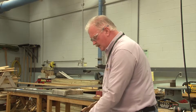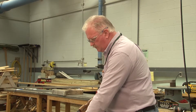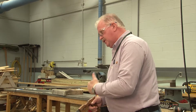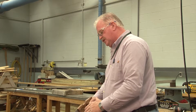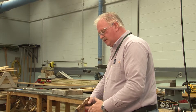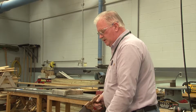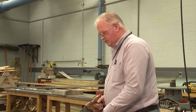Once we've got our saw kerf started, we've used our thumb as a guide. Now the proper ergonomics is being used to keep the saw cut. If for some reason my elbow is out, then you can see here we now begin to torque the saw, and we'll often get a little vibration every time we come back through.